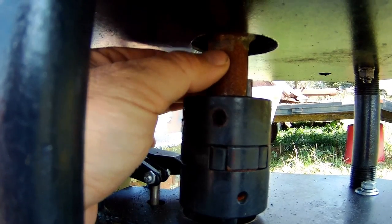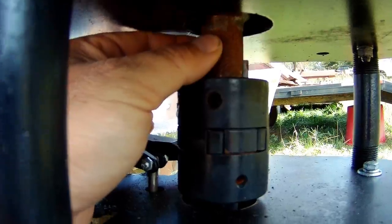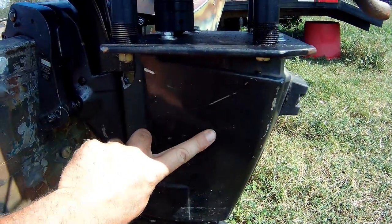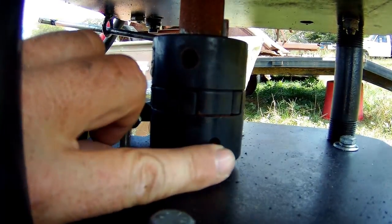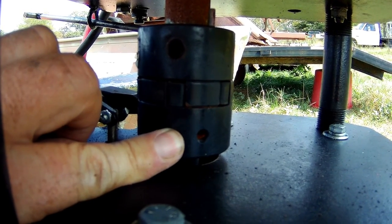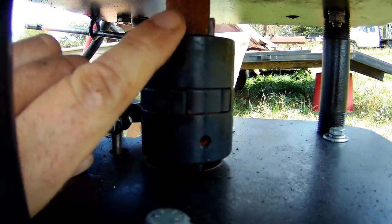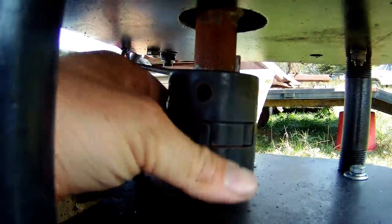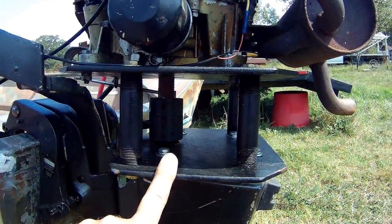This is a one-inch shaft up here on this big motor. The factory motor that was on this lower unit — I cut the crank out of it and put it inside this love joy, and it was a three-quarter-inch fit perfectly on the center. So we basically made a three-quarter-inch to a one-inch shaft adapter with these couplers. They bolt right together, they're the same outside diameter, and they're balanced well.